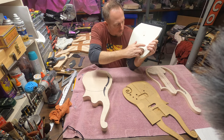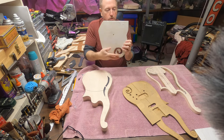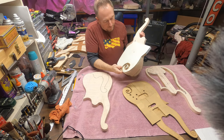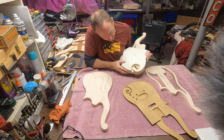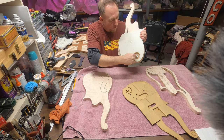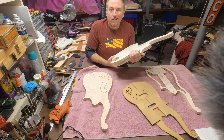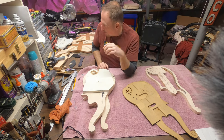So I got this real good. This is kind of ugly, but by doing that, you'll notice I've got this part up to this part in the shape of the guitar. So I can take my guitar body and just line this up so that it's where it needs to be. Take my router and I can route right around there, making sure all the time to put a little pressure against this edge, because you don't want to go out. And don't try to necessarily do it all at once, even though it's a very shallow cut.